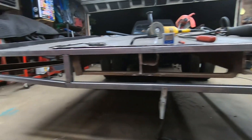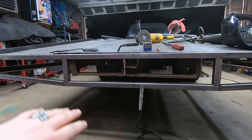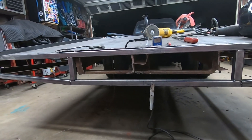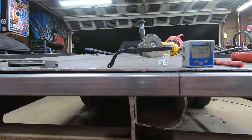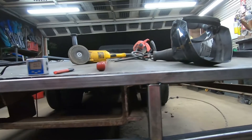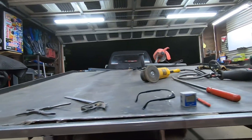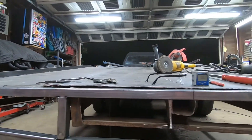I spent a lot more time cutting off the trailer hitch receiver and it's making a lot of sense why it was crooked. I finished cutting off the rest of the back bumper and started making the new one. The shape I opted for kind of flares up on the edges and then widens out in the middle - that'll give me a little more room for the taillights without dragging on driveways. But the center bar is not even remotely lined up with the centerline - my bar is to the right of the frame rail, and the distances between them are different on all of them.